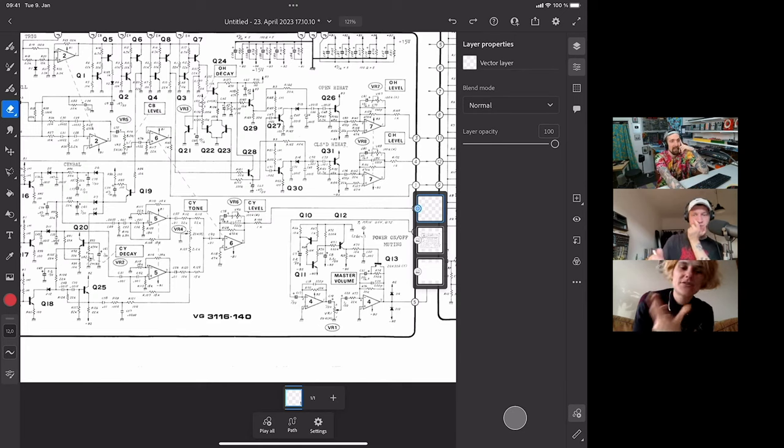The thing is that the transistors are supposed to be matched as well. I've never matched transistors. I have no clue how to do that. Of course, matching improves the sound quality, but it still works if you don't do it. I actually have the semis, because they made the ones for the famous VCO, you know, the 3340. Yes.